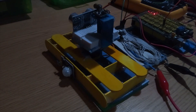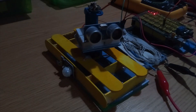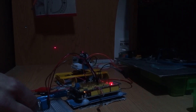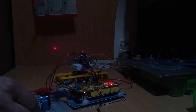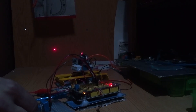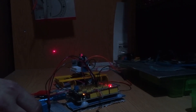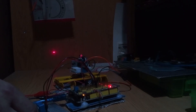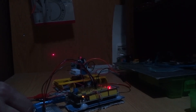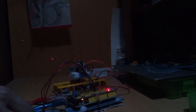The next step is to hook up the laser and get it working, then we'll move on to the motion sensor. You can see the intensity change quite clearly — we're at 100 PWM here, going up to 150, then up further to 200 PWM, and then going full intensity at 255. I'm going to try to work with my laser down at a much lower level — something like this, or even a little bit lower.